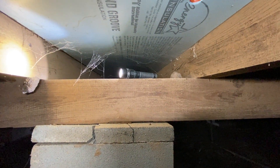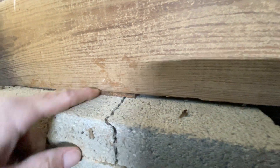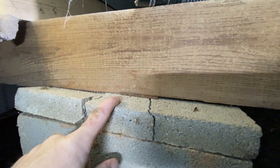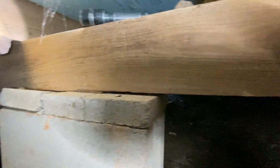The problem with steel shims is it takes all that weight from the structure above and transfers it right on top of this one little steel shim right there. That's about two and a half inches by about four, and that's a lot of weight to be resting on top of one concrete pad like this. You can tell it's just fractured it, split it apart. It's causing settlement.